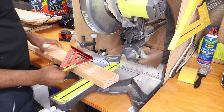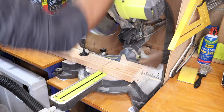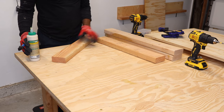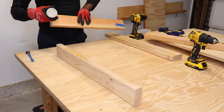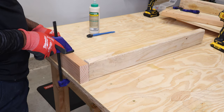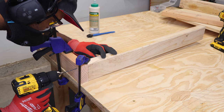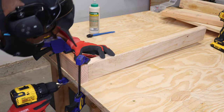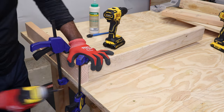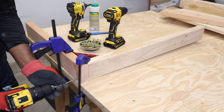Here I'm just using a piece of lumber that I've already used. If you need to make a cut on a circular saw, you can use a speed square. Now that all of our cuts are done, we're going to be putting out our pieces for our top apron. We're going to pretend we're going to use wood glue — I'm not actually using wood glue on any of these joints because I'm going to be using this lumber for another project. We're going to use the speed square and drill our first pilot hole. If you need to look at any of the tools, they are down in the video description. Once we drill our pilot holes, we're going to use a countersink bit to drill for our screws, and then use our other drill to put in our screws for our top apron.